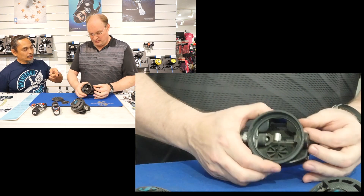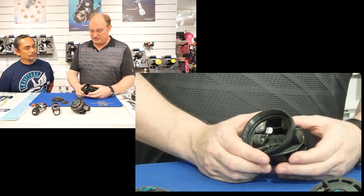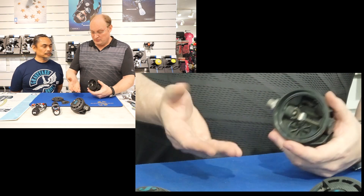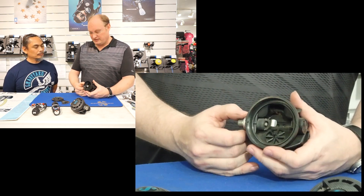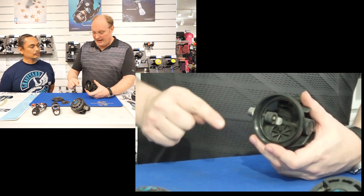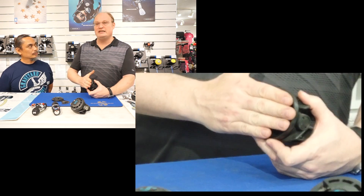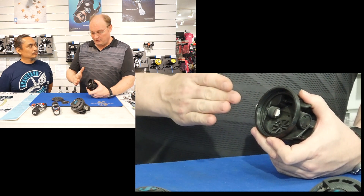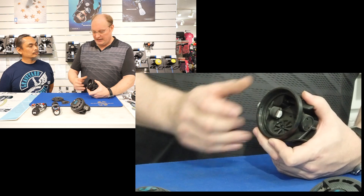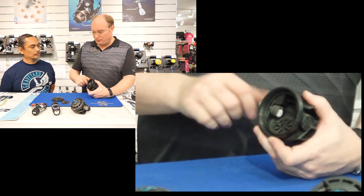It's like a flap that goes up and down and deflects the air. When I open the flap up and put it into the dive position, the air is deflected straight out of the mouthpiece. With that, the venturi effect kicks in — venturi effect means air is sucked along with an existing airflow. The air exiting the mouthpiece sucks other air with it, generating a vacuum inside the second stage housing. The diaphragm, which was pushed down when you started to breathe, stays down due to the suction, and the regulator will, so to speak, free flow. That is the dive position.